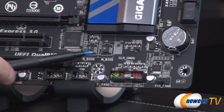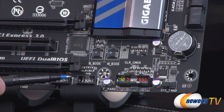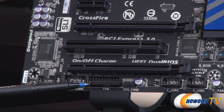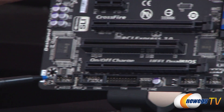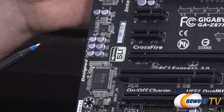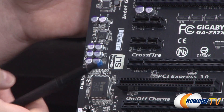You can also see the dual BIOS chips right here — they're soldered onto the board. The backup BIOS can be a life saver from personal experience. There are a couple USB 2.0 headers, each supporting two USB 2.0 front or rear panel ports. There's a trusted platform module header, more used in security and enterprise environments, and a COM header for legacy COM devices. Over here you have your front panel audio as well as SPDIF in and output headers. Along the left side, the Realtek ALC892 codec chip handles audio, supporting 7.1 channel output, plus SPDIF in and out via those headers.